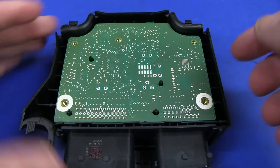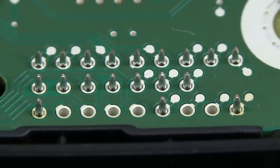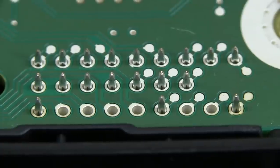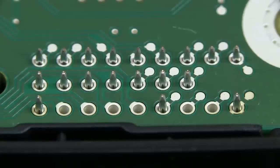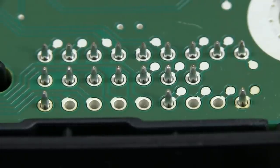We're going to have to try and lever this board out. These pins are really quite interesting — as you can see, they are not soldered. They are actually press-fit pins, which as the name implies you just press into the PCB and they hold themselves in place with friction. You might think airbag controllers have to be ultra-reliable, past many stringent approvals and type testing. And you might wonder how they can get away with not soldering the pins. Well, these press-fit connectors are actually incredibly reliable, but there is a lot of art which goes into getting them right. The exact diameter of the pinhole, the plating, and getting just exactly the right pressure on those press-fit pins.